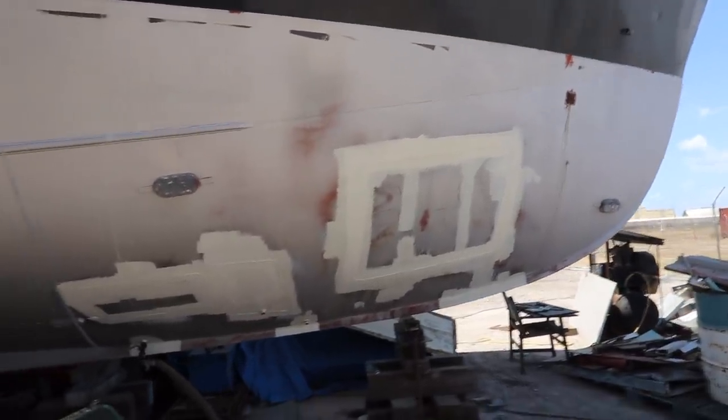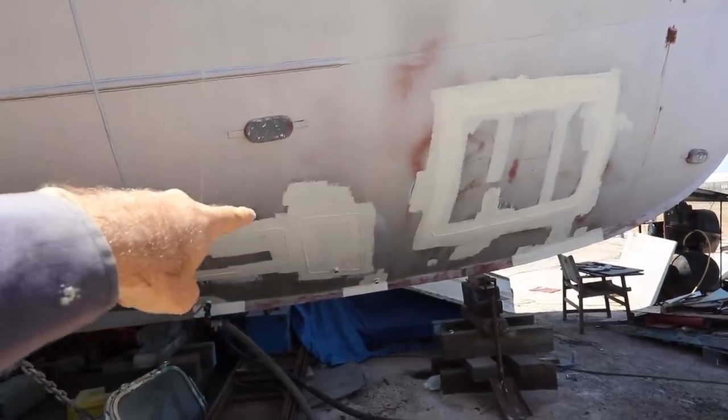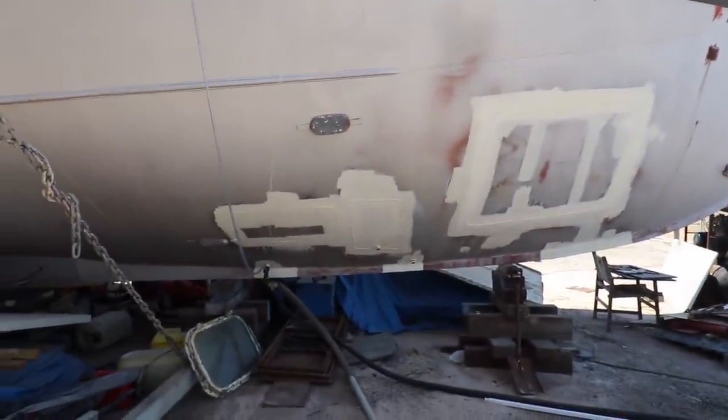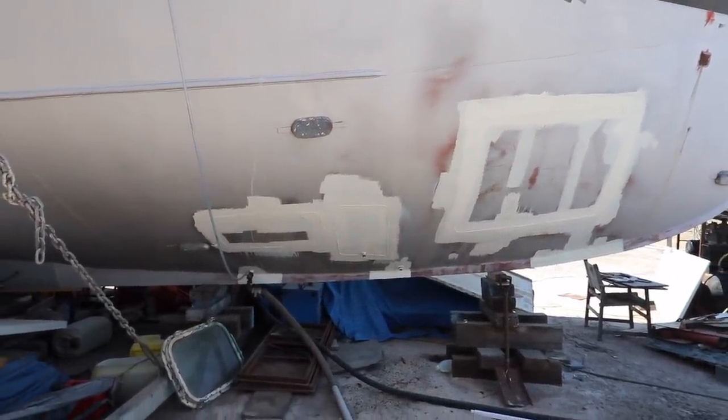If we rupture that, we move back to the cofferdam, which is this little square you can sort of see down the bottom there. That's half a metre wide, and it goes right up to the deck, so it's maybe 3 metres tall, just above the waterline there, about 2 feet above the waterline, and then right the way down to the keel. That's another tank, so if it ruptures, that again arrests any water going forward.